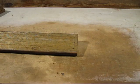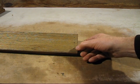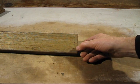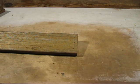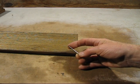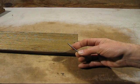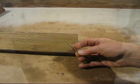Years ago, when I first started making moulding boxes, a friend of mine who was a carpenter was watching me and I was having a lot of trouble. Anyway, he said, if you nail really close to the edge like that, pre-drill the holes first and that'll stop the wood from splitting. The other tip he gave me was with the nails, take the sharp edge off the end. That will also stop the nail from splitting the timber. So that's what I've done.